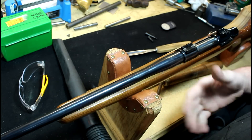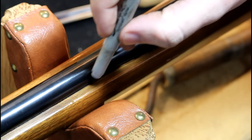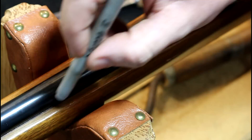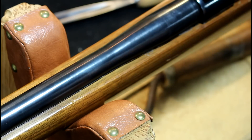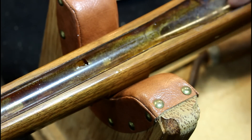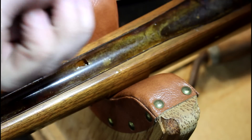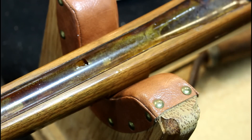All I'm going to do is come along here and just use my Sharpie and keep the same angle — this is just a guideline so we don't go further than we want to. We can go a little deeper down in the bottom, that's not as big of a deal. But when we get along the sides here, we want to basically just sand that line off. We don't want to take any more, and if we take less that's fine, but we won't take any more.